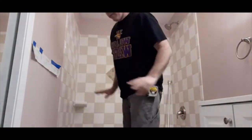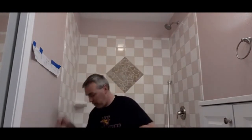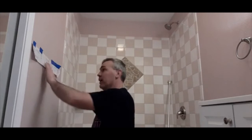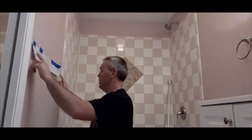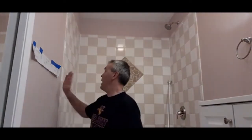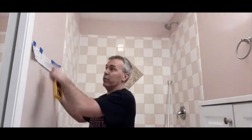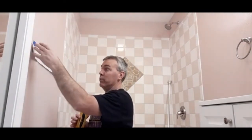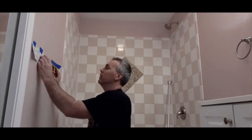All right, I'm almost done with everything here. I'm doing the towel bars. I got the hand one there. I did the toilet paper holder on the side of the cabinet. So I just want to show you guys how we do this. You get a little template and it tells you where to drill the holes for the little brackets. I knew where the stud was here, and then we put the block in over here, so we knew that this was going to be a double towel bar. So I already know there's wood behind this. Take a small level and level this in.